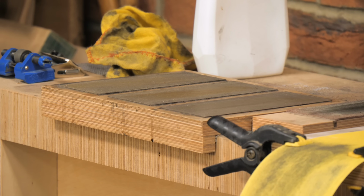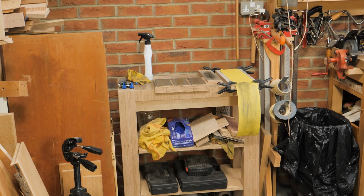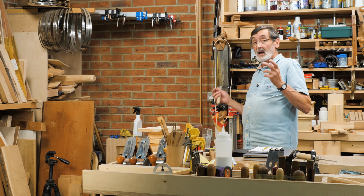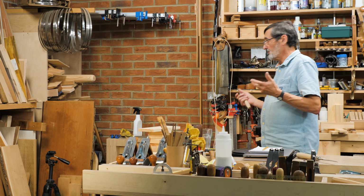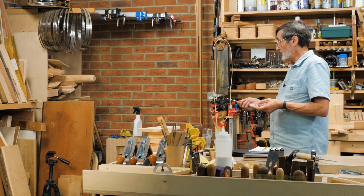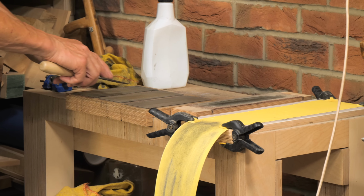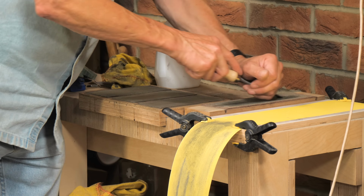Maybe it won't last as long. So I've been using these plates here. These have been imports that I brought in, and I've been using them for about 2 years, and they seem to be holding up just fine. So I take my chisels, I go over here. Now remember, I might have lots to do. Sometimes I'll sharpen 20 or 30 tools all at once. So I might come over here just to keep my bench clean. I'll go to the coarse, fine, super fine, I'll go to the strop.